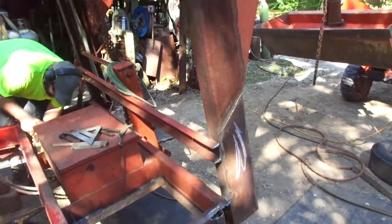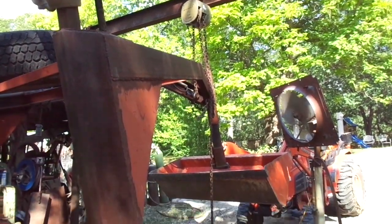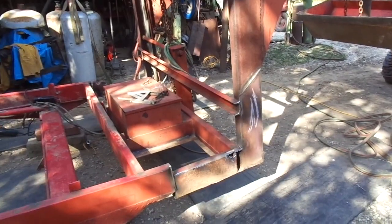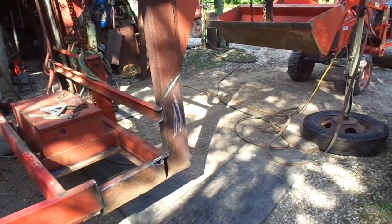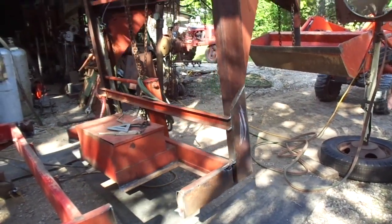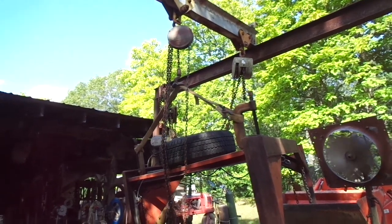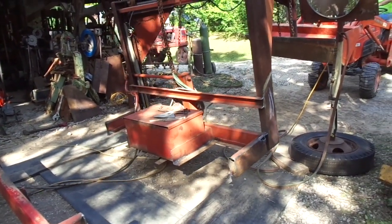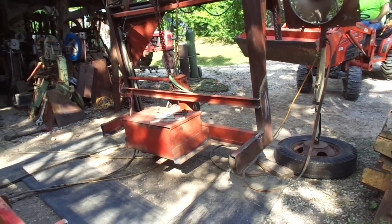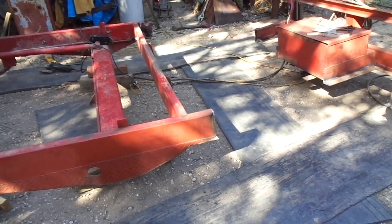What we're doing when we're disconnecting this in a fashion is going to allow us to reinforce everything that we're rebuilding. We're taking time to make some very specific cuts at this point. We've got the A-frame supported up here with the overhead — one of the chain falls holding there, the second one ready to hold there — and we've also got the bucket of the tractor to catch it right there in case we have an emergency. We're pretty much cut off with the angle grinders and then we took a torch and finished up the last little bit. Now we're going to separate the gooseneck — he's backing up real gentle. The trolley carries right along the I-beam and allows him to separate it exactly the way we want it. We're going to secure it up on some stands in order to work on it more carefully, true it all up, trim it off, and cut it where we want to make the joint.